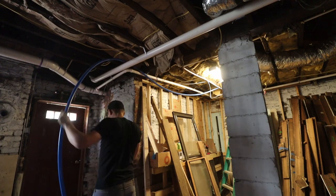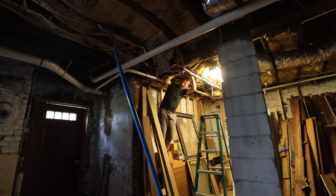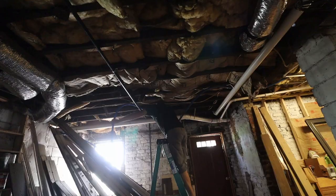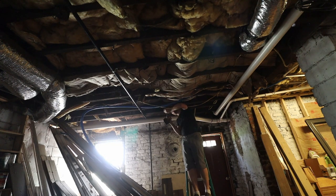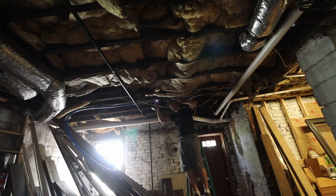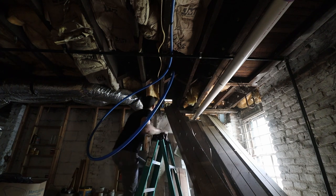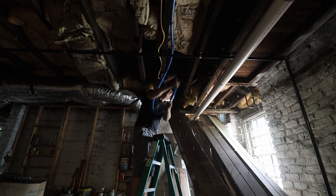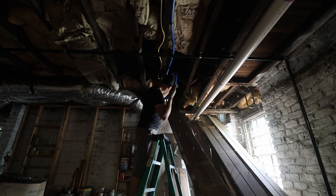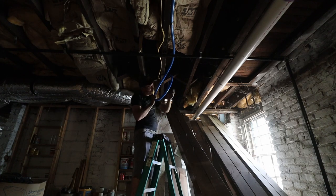And because of that, as it's still warm, that plastic has a memory of that coil, and therefore it's really hard to get it nice and straight. You can buy these tubes in shorter pieces too, which are all straight, because at that point they're just cutting it off right away and laying them. If I would buy them in the straight pieces, they would only be 20 foot long. So in the 20 foot long sections, I might actually have somewhere where I need 30 or 40 feet, especially when I need to make my big trunk line.